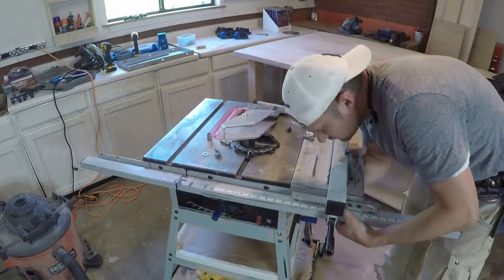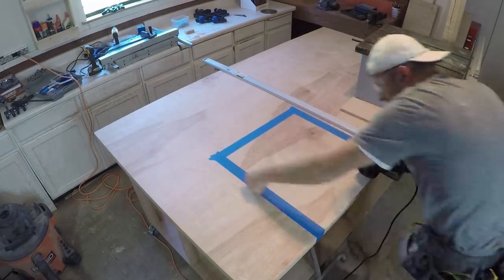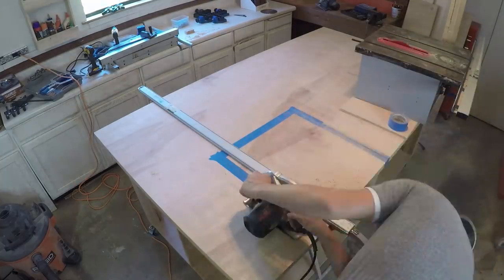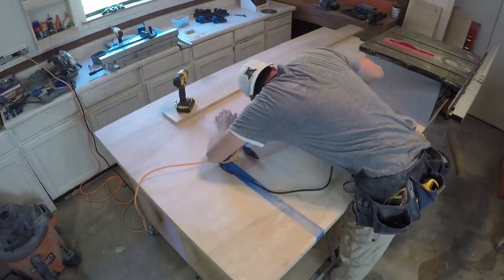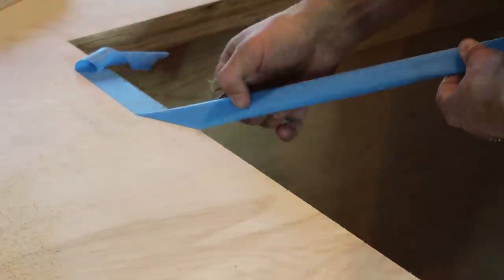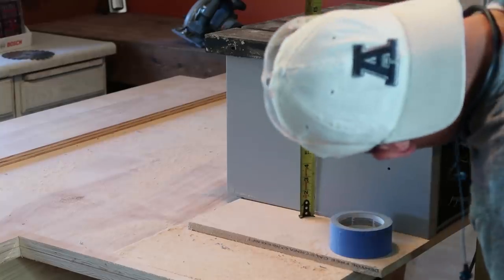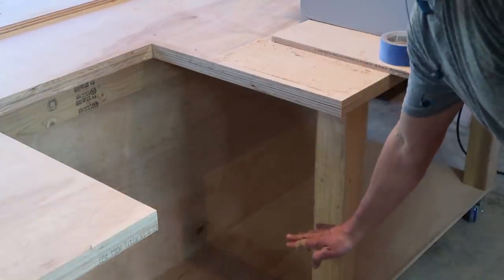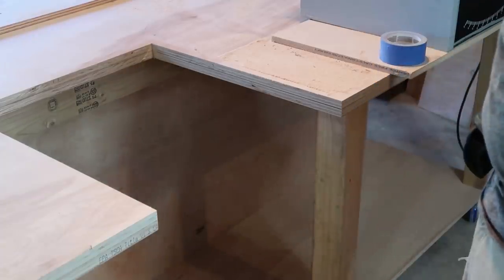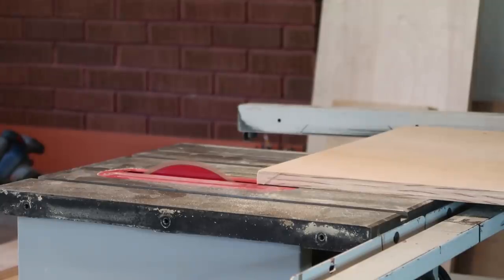Next I'm going to take apart my table saw, measure exactly how big a space I need, and cut out a hole for it so it slides right into this spot — that'll be the new home for the table saw instead of on its current stand. I also noticed that taping the edge was a really good idea because it protected it when cutting. Now I'm going to build the shelf that the table saw is going to sit on. From the surface down to the top of the shelf is 12 and 3/8 inches, to make sure the surface of the table saw sits flush with the bench top. The pieces I just cut out for the table saw hole will become the two side legs supporting the table saw shelf underneath.